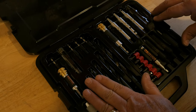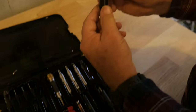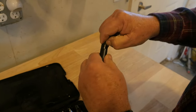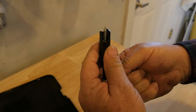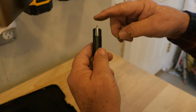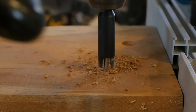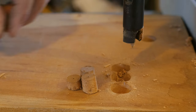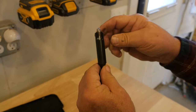So you have three great sets of tools here. What's also included is this — and notice there's a cover on it because these are very sharp. These are plug cutters. They come in five sixteenths, three eighths, and seven sixteenths. That centering bit, which is very sharp, stops the cutter from wandering so you can cut plugs in wood that match any countersinking you're doing. So you have matched plug holes, or if you want to do contrasting ones, these are a really nice set.